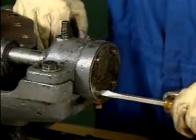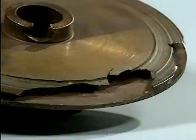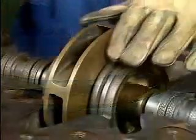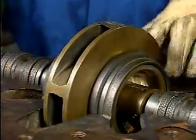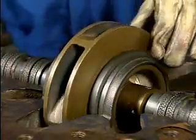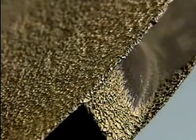The impeller is the key component of a centrifugal pump because it moves the fluid in the pump. Damage or other problems with the impeller will result in a loss of pump efficiency. The impeller might get clogged by solid materials in the pumped fluid. The impeller might have been mounted incorrectly during an overhaul. Or it could have worked its way loose from the shaft, in which case it would not rotate at all. Another possible problem with impellers is damage from cavitation. Damage caused by cavitation most often appears along the edge of the impeller.